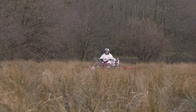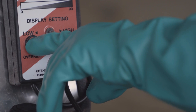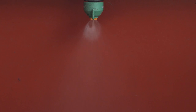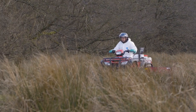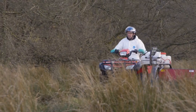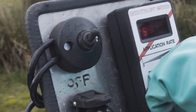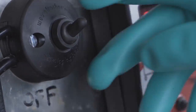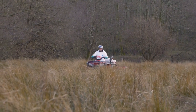It will also make cleaning your equipment much easier at the finish. The override button allows the operator to top up the brush with chemical when considered necessary, for instance in a thick canopy. However, only use a quick six-second top-up to avoid dripping. Never constantly press the button as you will be applying far too much chemical mix — the resulting drips will cause sward damage. If dripping occurs, turn off the machine for a short time while still continuing to wipe, or potentially turn the control box down to a lower setting.